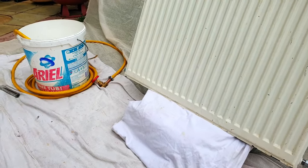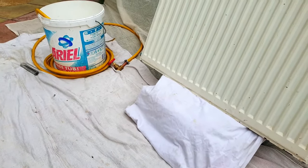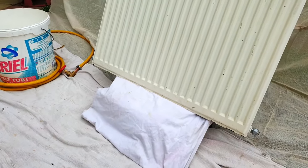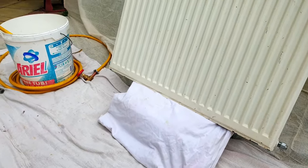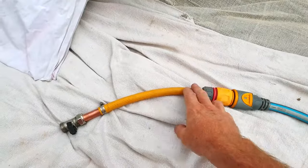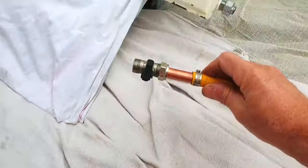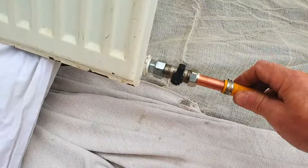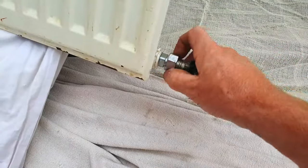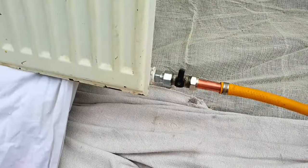It stains really badly and you're going to end up with filthy marks all over your patio, filthy grass, and if you walk it into your house you're going to make a right mess. So make sure that you flush into somewhere where it's not going to matter. I've got my hose pipe turned on. I've made this special little adapter — it's basically an isolation valve and a bit of tube — and I can fit this directly onto the radiator spigot and do this nut up so that it's now connected onto the radiator. Right, so that's that one connected.